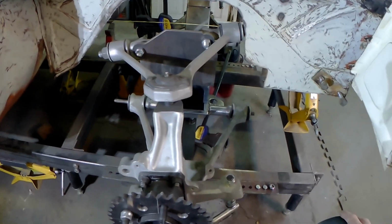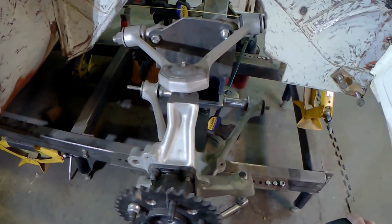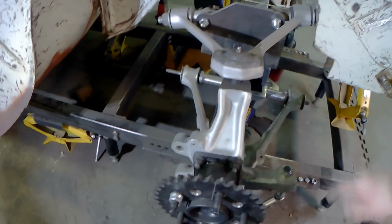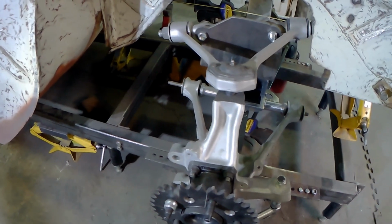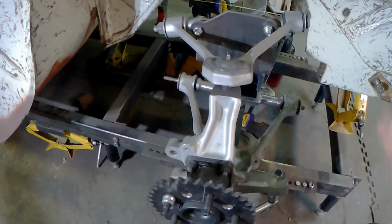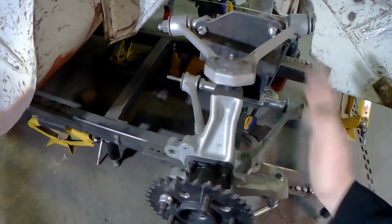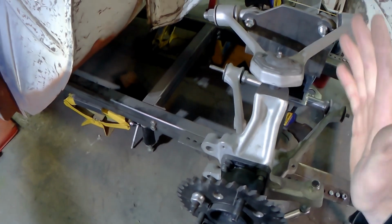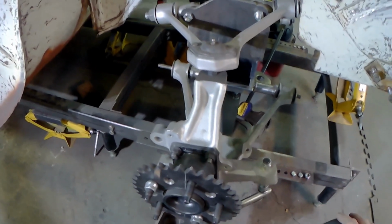And the Volvo, I think stock, has like half a degree of caster, which is sort of what you want when you're manual steering a car. You're rotating straight on the pivot. Well, this has got an angle that goes through like this. Now, that's actually advantageous, again, for handling. If you've got caster in the system, this is 7 degrees, something like that, then as you're turning, you're actually gaining camber, which is what you want as you do that.